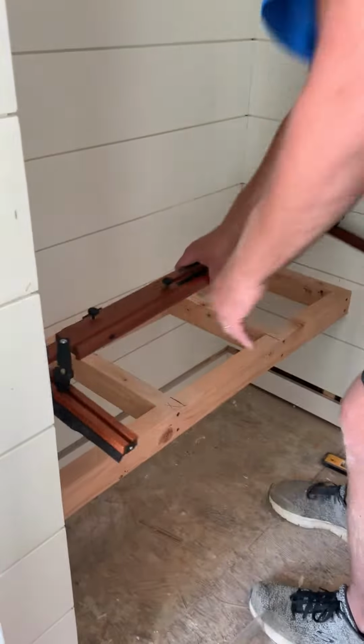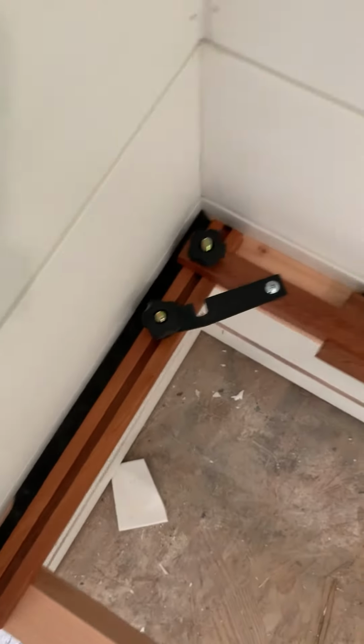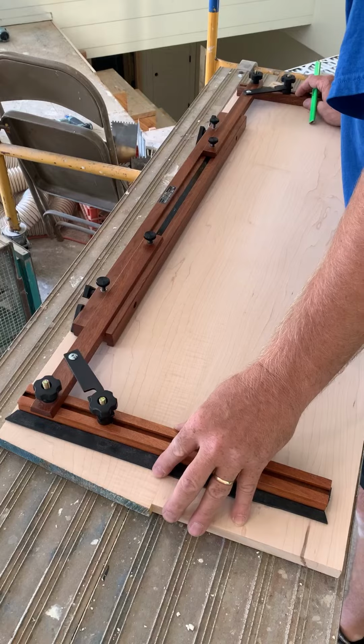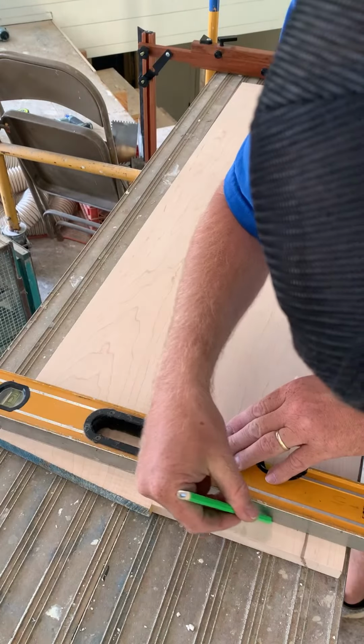Now here's an awesome tool. It's the Stair Wizard. I use this to put in treads on stair stringers, but it comes in clutch for this application right here. Instead of making a pattern, having to cut it 2 or 3 times to get an exact cut, you set it once, and then you take it over to your top, scribe it, and we're ready to go, man.